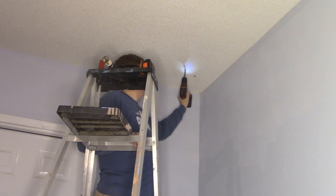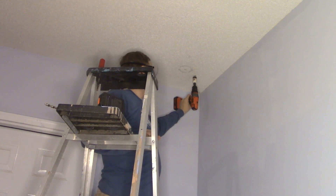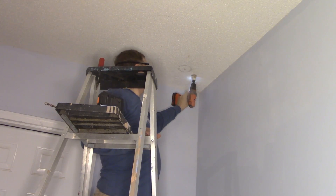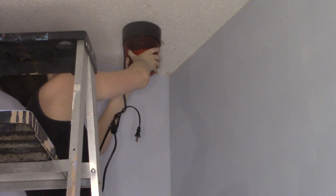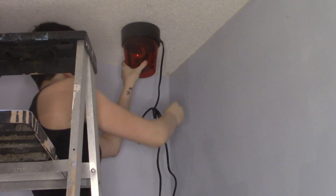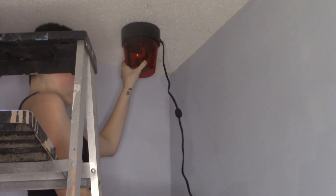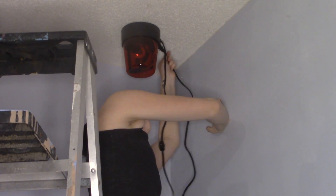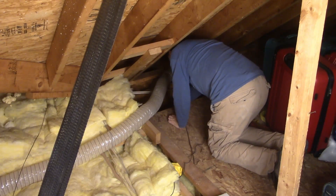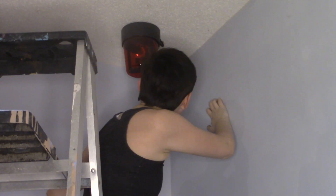Back down in the garage, the original rotating beacon has been removed, and the small mounting hole is enlarged to a quarter inch. The small power hole is also enlarged for the plug to go through and be plugged in upstairs. I'm wearing eye protection because there was sheetrock everywhere when I drilled these holes. My assistant inserts the quarter-inch bolt into the hole we drilled, and up in the attic I'm putting on a washer and nut to hold it in place. The rotating beacon weighs practically nothing, so one bolt is more than enough to hold it against the ceiling. Then she turns the light to hide the cord and untangles it so we can feed it through the hole and pull it into the attic. And there I am pulling that 110-volt cord right up through the hole — plenty of slack. Looks like it's supposed to be there.